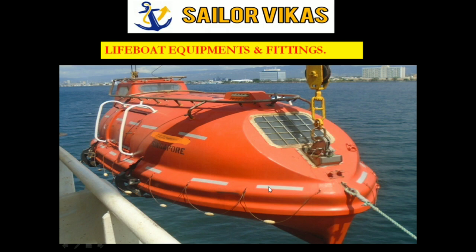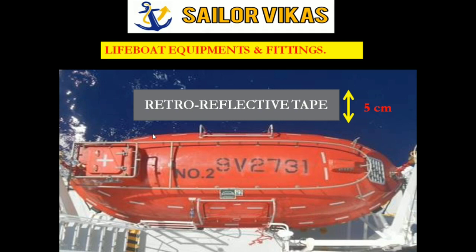Now this retroreflective tape has a requirement that it should cover an area of minimum 150 centimeter square. This is one retroreflective tape. Here the vertical distance is 5 centimeter and the horizontal distance is 30 centimeter. If you cut this size of retroreflective tape and paste it, then it will comply with the minimum area which should be covered, that is 150 centimeter square. That is only for one retroreflective tape.